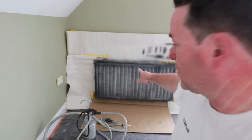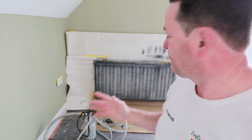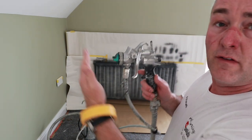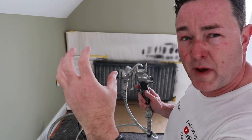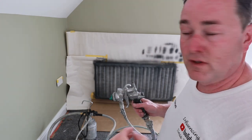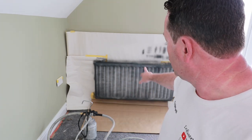Can you see how patchy that looks? That's intentional — I turned the paint flow down to get a light coating on because I didn't want too much paint going on. The trouble with spraying is if you've got the gun too close to the surface, it applies too much paint in one spot, and if you're not moving quickly enough you start getting runs. I didn't want any runs — the paint's quite thin but it's gone on nicely. That will level out lovely — the Bedek MSP sprays beautifully.